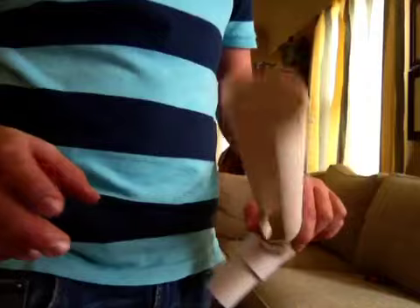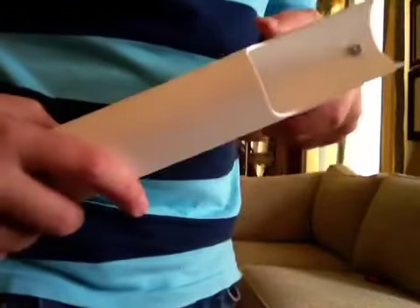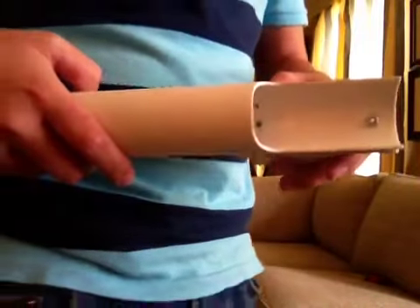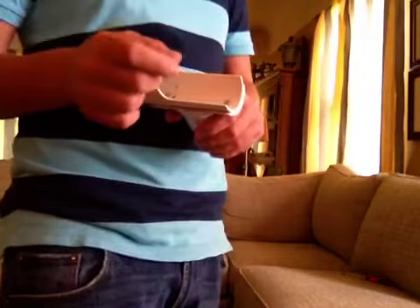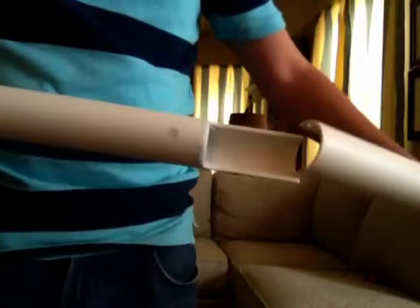I got this one-and-a-half inch thin wall at a Tractor Supply store — that's the name of the store. They don't just supply tractors, but it's the name. It's bolted on here with a bolt in the front and three in the back. The bolt in the front and the middle one in the back are from an erector set — a toy set with metal bars, screws, and stuff. With the bolt sticking up and put on the body of the pump snap, there's a perfect amount of friction so the pump slide can stay in any position, but still moves smoothly by hand.